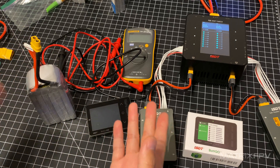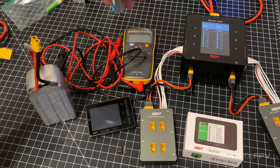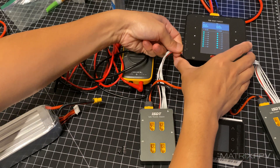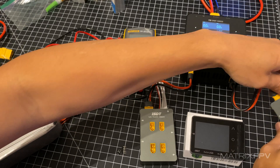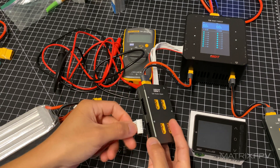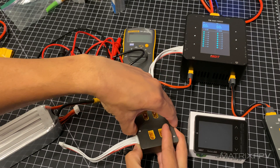So I recommend going with a pretty large pack. For this setup, I'm going to show you how I calibrate with this unit since I've already set this up. What we'll do is unplug the battery balancing port from one of these channels — I'm going to unplug it from channel 2 and plug it into this port right here. Make sure you align it to the negative side so that the LiPo channels show up properly.